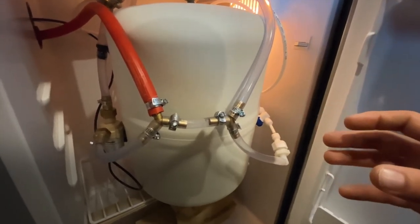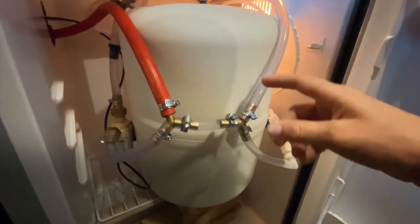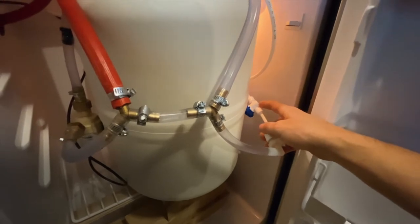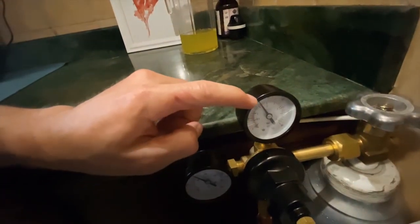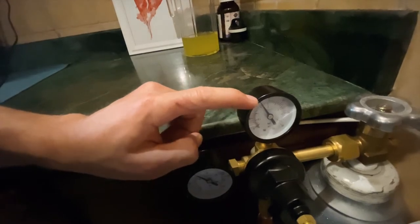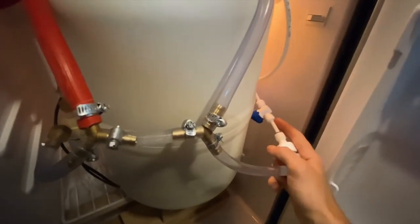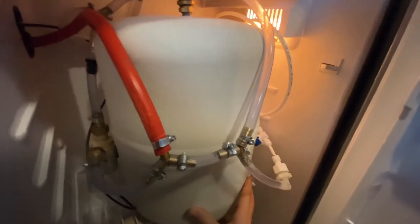It's a little bit tricky on how you can force water into a system that's pressurized. Essentially, you need a strong pump on this side that's more powerful — it does higher PSI than the air that you have coming from the CO2 tank. The CO2 is set at about 24 PSI right now; I normally do about 20, but right now I'm doing 24. And for me to bring water in, I need to be able to pump higher than that. So now I'm going to go over to where the water comes in.